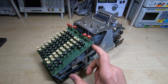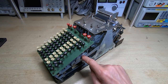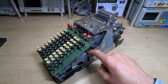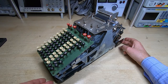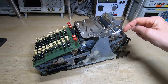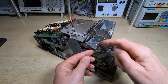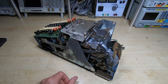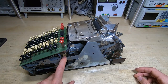The start bar is refitted. It was bent under and jamming - when I tried to push it down it would wedge against the bar, which is why I took it off. Now it's perfectly free. Apart from raising the lever, this also interacts with the control cam for the cycle. There's a notch at this point that stops the machine at the end of the cycle. To start the machine you have to raise this pawl which releases the catch - there's a step on the cam and raising this allows it to rotate.